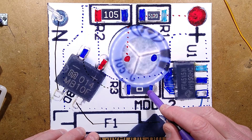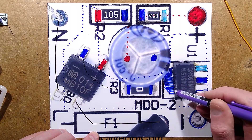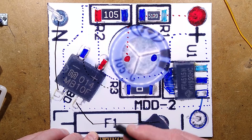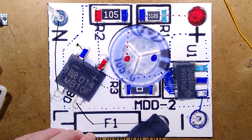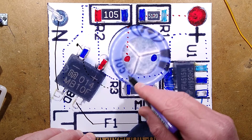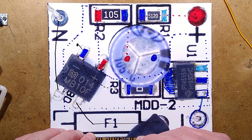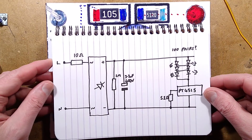There is a zero-ohm link here — this is perplexing. The dotted outline here is the heatsink plane on the back of the circuit board. There's a bunch of plated-through holes under here that couple onto that heatsink plane, and it basically just avoids all the pads and goes around the circuit board. Oddly, the route of the negative connection is such that if they already had the negative plane there, they could have just put a plated-through hole and gone straight onto the negative pad — but they didn't. Is this zero-ohm resistor link there for thermal isolation? I'm not sure — it's a strange arrangement.